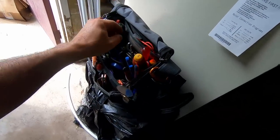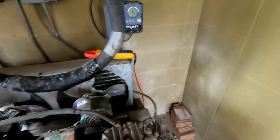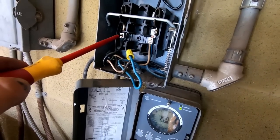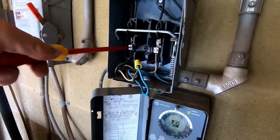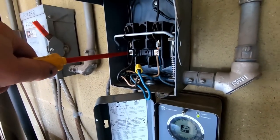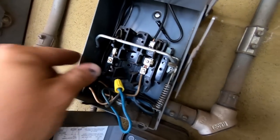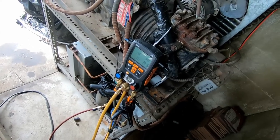This green wire, which is actually a power wire, has been wrapped with black tape. You can see the wire moved really easily — that's probably loose as a goose. Checked the amperage and it's pulling about eight amps. Tightened it up and it doesn't wiggle anymore.